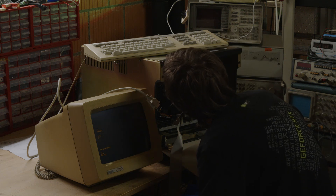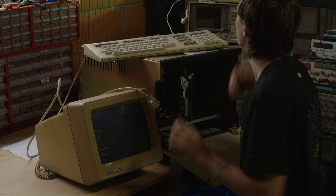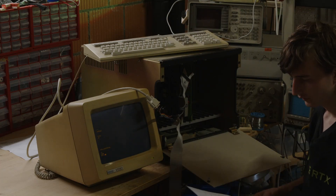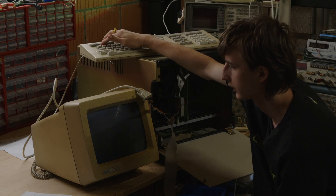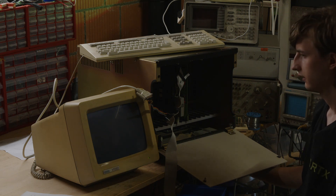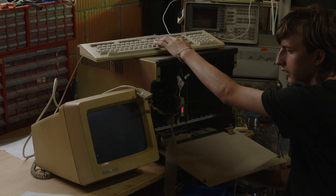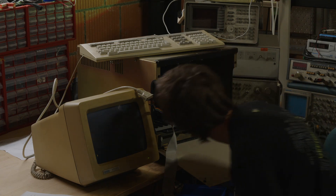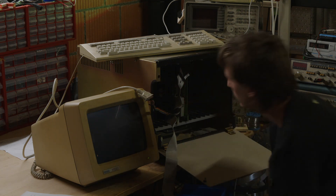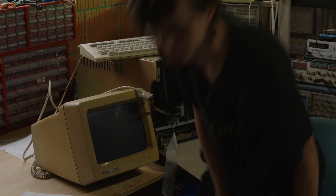I could think that it wants some synchronous communication, which would mean we need to hook up a lot more stuff - we need to hook up RTS and CTS for modem control. So that should now use modem control. When I turn it on - does not work. I'm not really sure if that's actually a problem with the terminal. I'll go around and consult some Discord knowledge to figure out more about this whole situation.